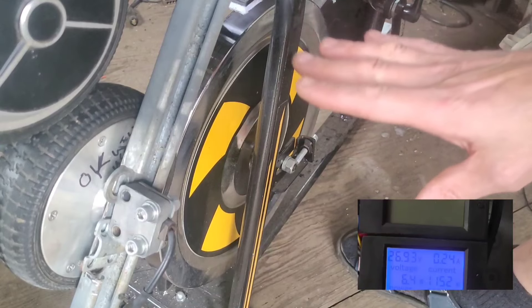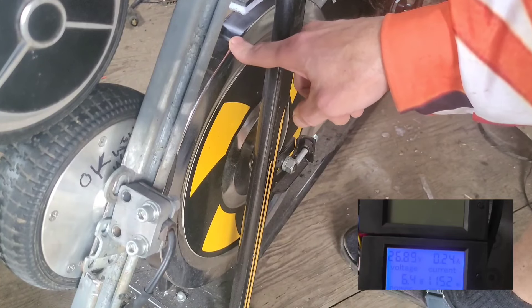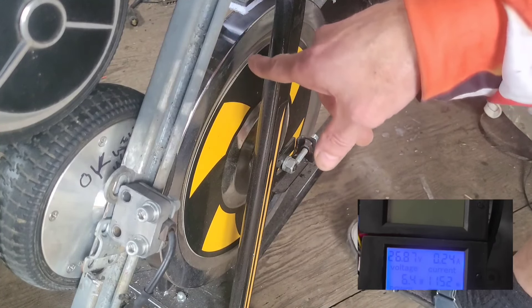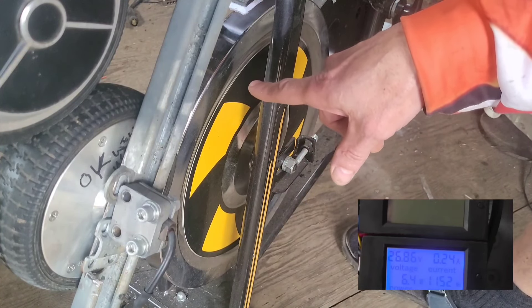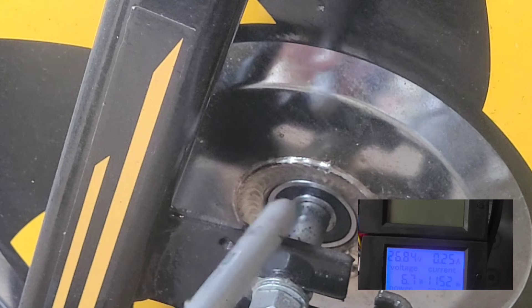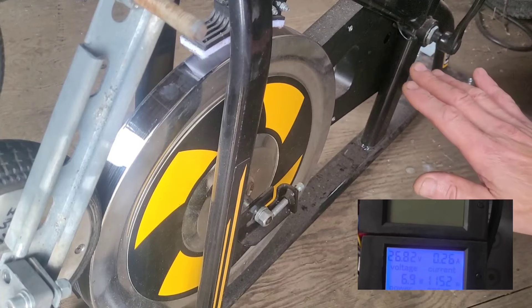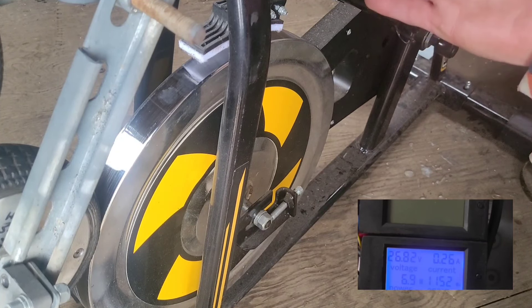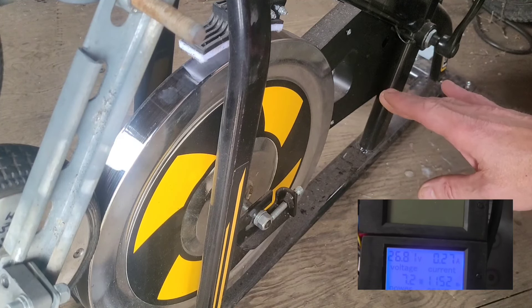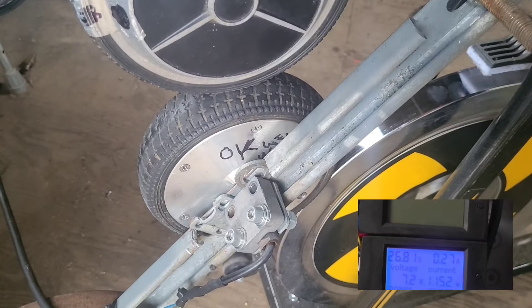That is a video about the bike, and the only claim I'm making is that this bike is perfect for this application. You could spend years and years trying to make something yourself, but this is perfect and it's because of the 8.5 to 1 overdrive ratio, the fact that we have a super smooth bearing in here so there's virtually no loss, and the weight definitely makes a difference. So if you're looking to make something that transfers human energy into power, this is what you need — don't bother spending days, months, years looking into it, this spin bike is exactly what you need. It's perfect. Right, I hope you enjoyed the video, thank you very much.